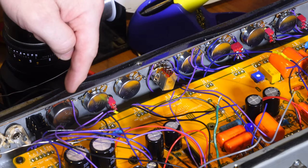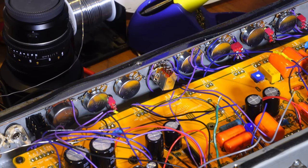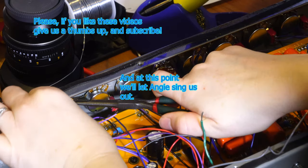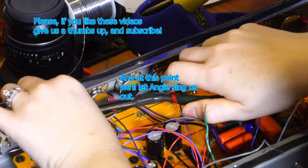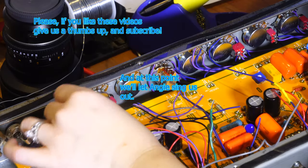Angie did get some time to come help out today. I was just starting to wire in the presence pot - what I couldn't reach was jumpering between the middle terminal and the side one. I got the wire in the middle terminal but couldn't get it over to the left side terminal, which is why I had to rotate it. Now I've rotated it. The blue wire will just go in the first terminal that's left over. Please go ahead - and I'm going to go slowly.